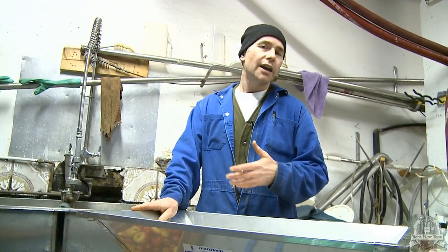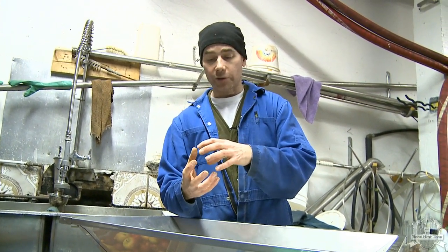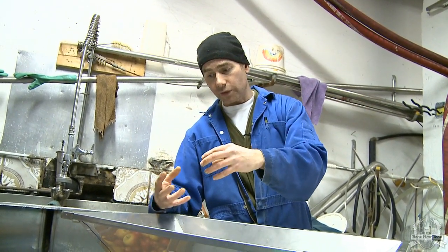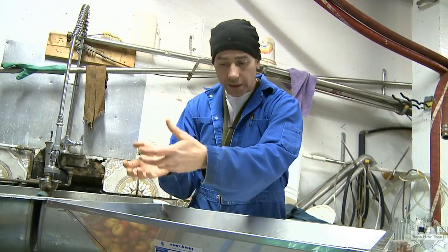Usually you have to cut every apple in half, but if you're just trying to do a 20 liter batch it may be totally worthwhile — you can pick up an old garbage disposer for maybe 10 bucks or even free. Other things people use: there are devices where you drop apples down a chute and there's a whirring spinning blade, like a garbage disposer but bigger — basically a blender blade. People sometimes make their own: take stainless steel and bend the edges up, get a motor on it. The apples drop through the chute, hit the spinning blade, and the whole thing is surrounded by a screen. The crushed apple material gets spun out through the screen into an outer area, and that apple must drops out to be collected.